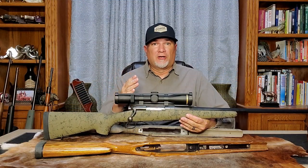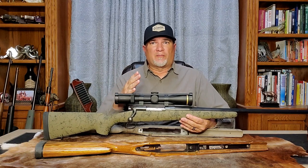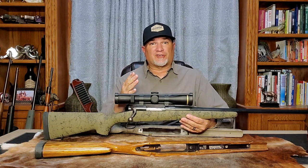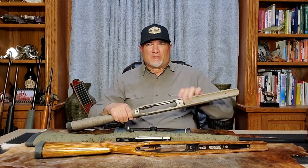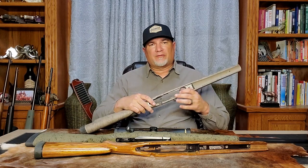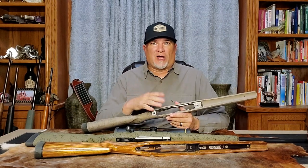After I posted a video about my last rifle build project, I got numerous emails from people asking me about skim bedding. Specifically, people really didn't seem to understand what skim bedding is. There is no real exact definition of skim bedding that everyone will agree upon, but the term skim bedding is generally in reference to a light epoxy coating — epoxy bedding over an existing bedding block.